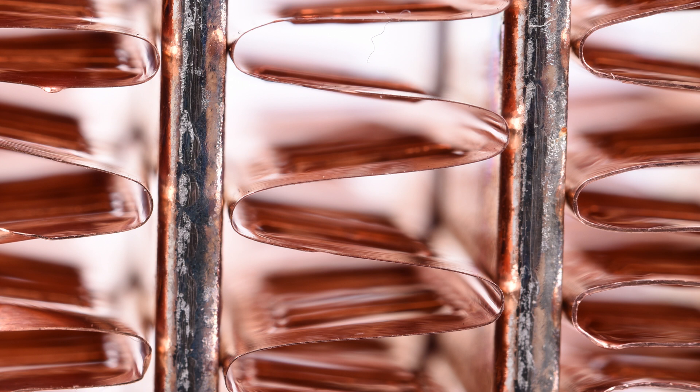As copper is far better at removing heat than aluminium, we also use it for the fins of our radiators. Although the fins don't touch the fluid at all, they along with the fans radiate and get rid of the heat. Now, we said that all the channels were copper yet they're obviously silver in colour — is Alphacool sus? No, don't worry, this is just solder. The solder allows us to attach the fins to the channels, and it doesn't affect the performance at all.